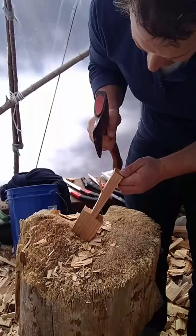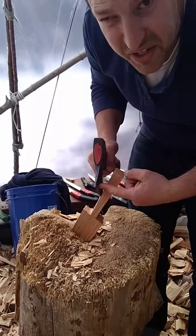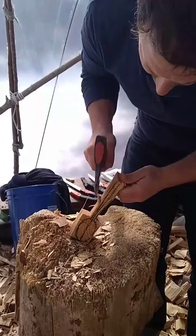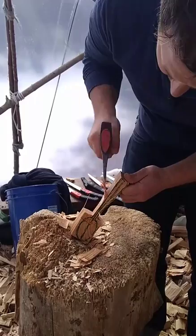Now with these shavy cuts, you still have to make sure that that edge engages, because if it doesn't engage, you're in danger of having it skitter down and knock into the shoulder and then put a crack in the shoulder of the bowl of your spoon. So it's all about edge engagement every single time, consistent edge engagement. And the edge engagement comes from torquing the axe.